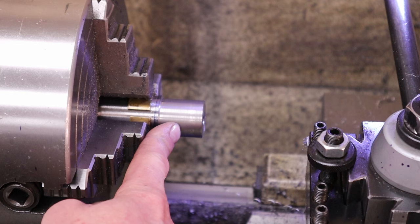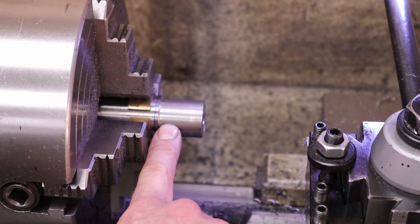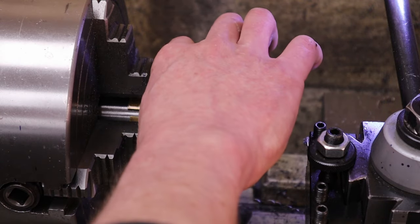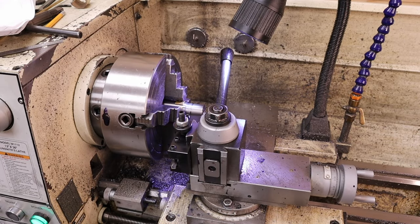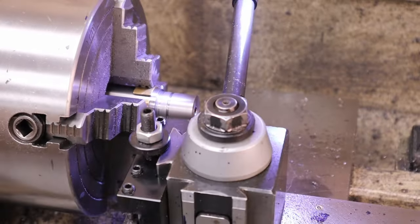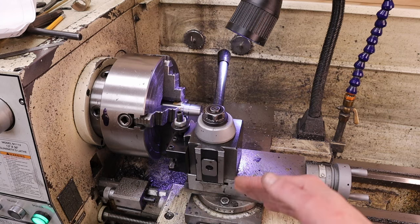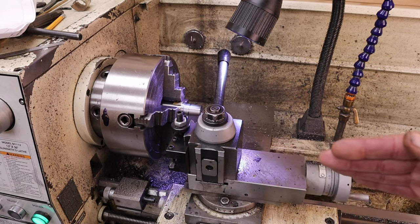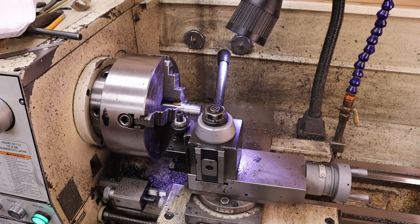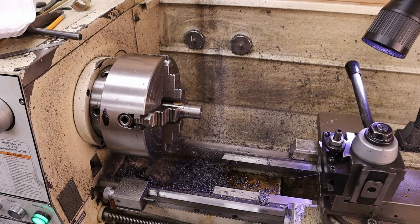The thread tenon would be 1 and 1/16 inches, which is 1.062 nominal, and then we'll cut the threads. Back at the machine now — I have all my lengths and diameters cut to dimension and within tolerance. For the taper on the switch lug I set my compound one degree from zero, which is how I was achieving that ten-thousandths taper.